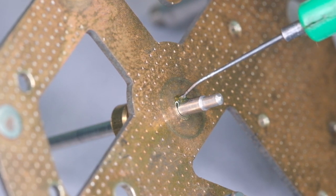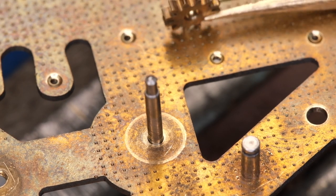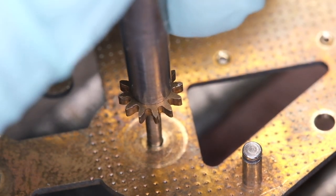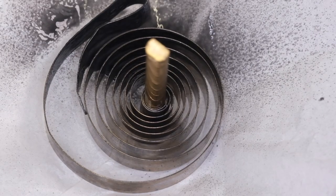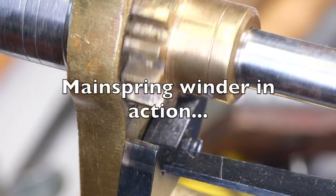And you can see I'm using quite thick oil here, Moebius D5 I think it was, because the clock's quite overdriven. It's got its original mainspring, but that's still more than strong enough to drive the clock. So having tapped the brass pinion back on, I put a bit of spray grease on the mainspring. I use a liquid spray grease here that contains molybdenum disulfide, again a link in the description before.